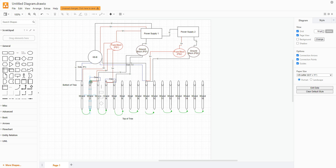At the end of strand two, I want the data pin to flow directly out of strand two into strand three. The power coming down here should split and go both directions — to the end of strand two and the start of strand three. This is safe because those power pins came from the same fuse block. Anytime you inject power, you also need to inject ground, so there's an ample return path back to the power supply.